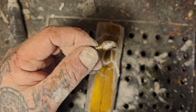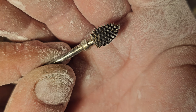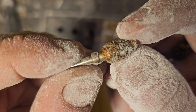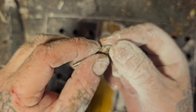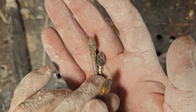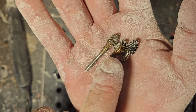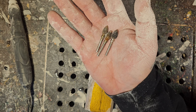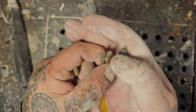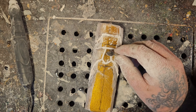Here are cuts-all burrs. The black one is the most aggressive - that's the cuts-all flame burr, that's my go-to burr for wood carving. You see these burrs have little spikes on them, so they leave marks in the wood or the epoxy. This one I'm showing now is less aggressive - that's the silver one, it's plugged up a bit. There are three different types of aggressiveness: the extreme black, the silver which is the original, then the gold which is fine. Here's all three - I'm going to try and show you the differences. Aggressive to the right, medium middle, softest to the left.